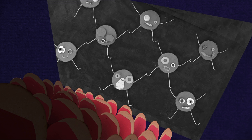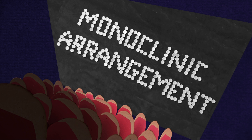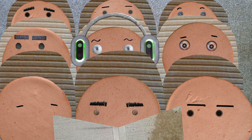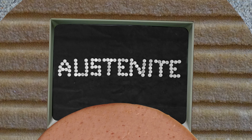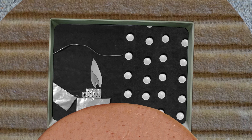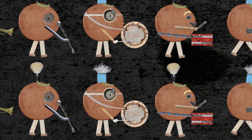What we're seeing is the shape memory wire changing phases when it gets hot. When the wire is cold, atoms are in a diagonal arrangement like the movie theater seating we talked about before. We call this a monoclinic arrangement, and scientists will call this phase martensite. When I heated up the wire, the atoms moved into columns like airplane seating. This is a cubic arrangement — scientists will call this phase austenite. So when we added the heat, the atoms shifted positions seamlessly, and they'll do this forever. They have this coordinated motion just like members of a tireless marching band.